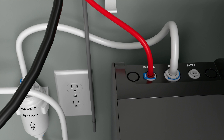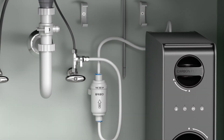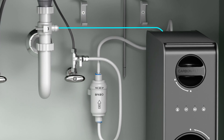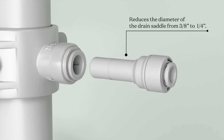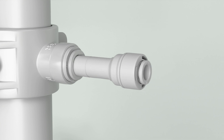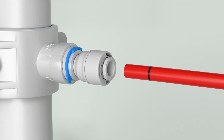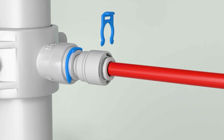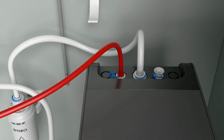If your faucet does not have an integrated air gap, follow the subsequent installation steps. First, turn off the hot and cold supply stops. Connect the waste line from the RO system directly to the drain saddle. Begin by using the included stem reducer, which reduces the diameter of the drain saddle from 3/8 inch to 1/4 inch. Insert the adapter fully into the drain saddle, ensuring it is seated at least 5/8 of an inch. Align the drain saddle and push the adapter in with force until it's fully seated, then secure it with a locking plate. Next, connect the included quarter-inch red hose to the drain saddle. Push it in until the reference line disappears and lock it into place with the locking plate. Finally, remove the plug from the waste port, connect the line, and lock it into place with the locking plate.